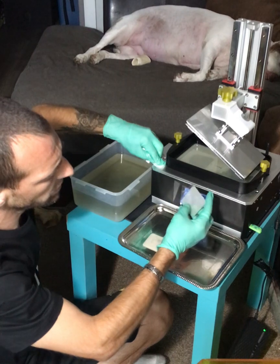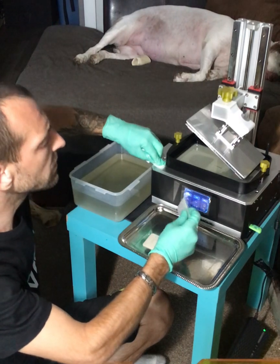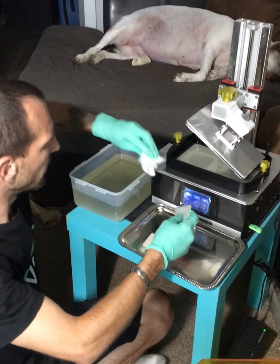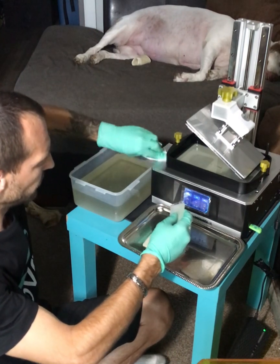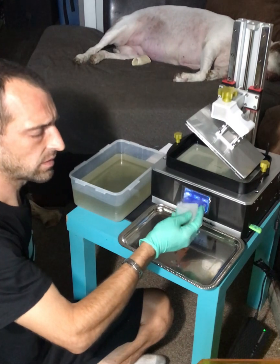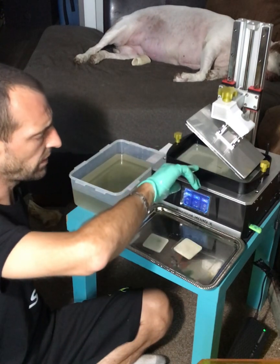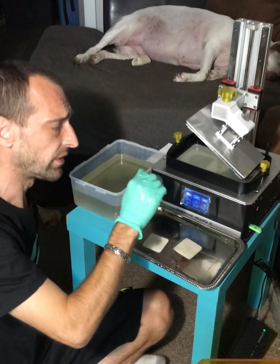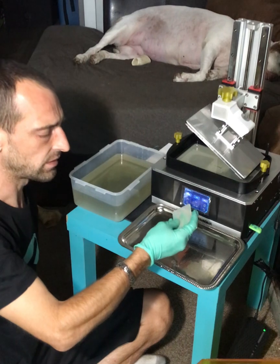This is just a much thicker print with a lot more exposure surface. So the suction, along with the old resin and not mixing it that well, it did not stick to the magnetic plate. So if this does happen, where you get a lot of suction force, you can clean your plate off real good with alcohol and scuff it up with some sandpaper, and that will solve the issue of it not being able to bite to the surface.